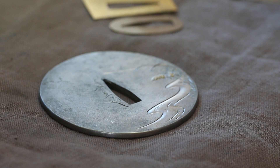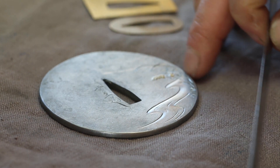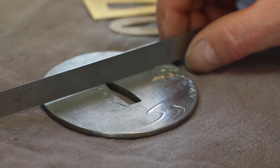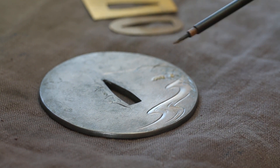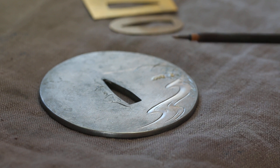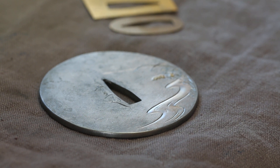A perfectly flat plate, in my opinion, is perfectly dull. It doesn't look right to the eyes — a flat, hard plate. So by giving it a very gentle taper towards the edge, still keeping a relatively flat edge but just tapering it a little bit, it feels better in the hand and provides a more gentle, full feeling when you look at it. What I really wanted was a very subtle stone-forged surface. I really don't want the hammer marks to be too overt or too rough — I'm really trying to simulate a naturally worn rock surface or pebble.